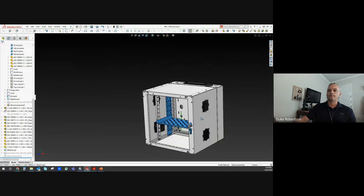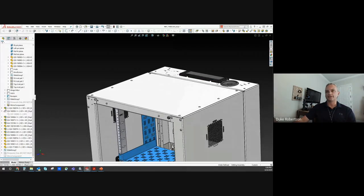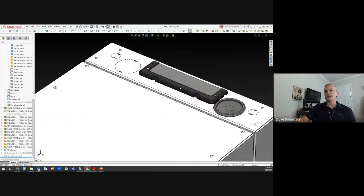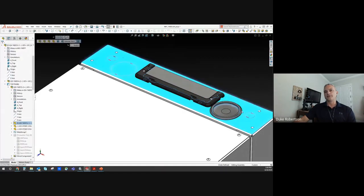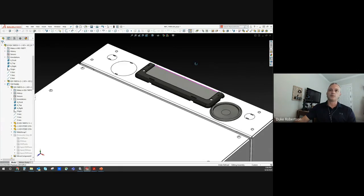So I mentioned one of the things we wanted to do was offer the ability to retrofit this around an existing installation, and that's what's going on back here with this brush. This brush is an optional accessory, but this top section here and the bottom section on the opposite side are identical, but you get a 1-inch knockout at either corner, and you get a 3-inch knockout right next to that for, I believe, 3/4 inch and 2.5 inch trade size conduits.